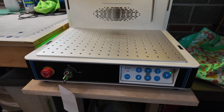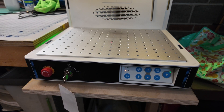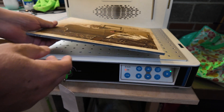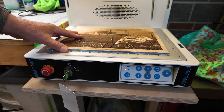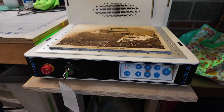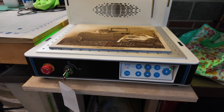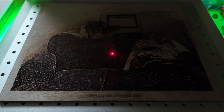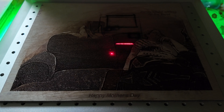Press the on button to fully engage. Because I'm going to be cutting material today, I've taken an old quarter-inch piece of scrap plywood because I don't want to mar or damage my work surface. With the machine on, I'll press the start button in LightBurn to start framing. We'll place our material, get it set up, focused, and then create a fridge magnet. I've turned all the lights off so you can more easily see the LEDs, the focus, and the framing dots. For today's video I'm going to leave my door up and disable the safety switches, but I'd highly recommend you always leave your door closed when engraving.